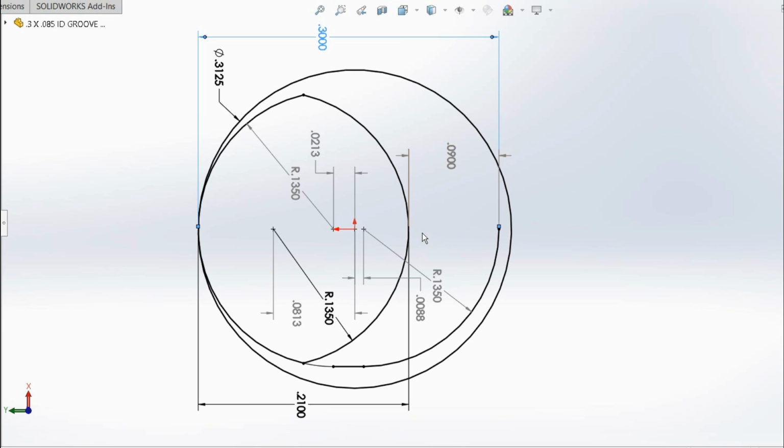It turns out most of the time you get a chip tangle or something and rip the heads off of these, and that's one reason why they're made with a brazed on head, so that the bar is still good and easy to replace. So this is all the layout that I did here for the locations, and these values, these offsets from the center of the actual bar, are what I use on the punch grinder to offset to grind these radii.